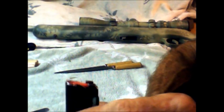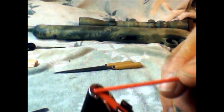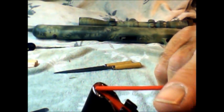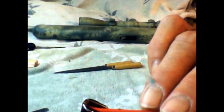The other issue with this magazine, well actually there's a couple, is the ramp. It's got a machined ramp, the bullet tips hit and go up in, but the bottom edge is really sharp, and the tips would hit that and then jam. They didn't want to slide past that break. It's simple enough to pull it apart and get a little round file and clean up that lower edge so that the bullets want to travel up it.